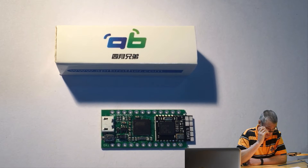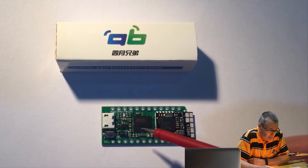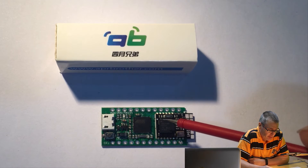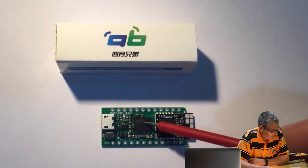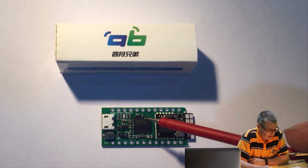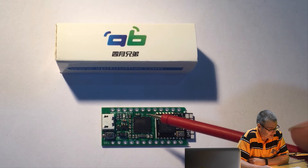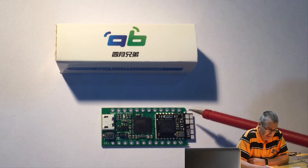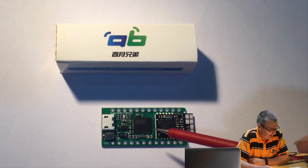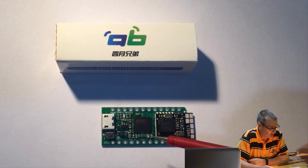The Blue Duino is an Arduino-compatible micro-sized PCB with a Bluetooth 4 module soldered on, supporting Apple's iBeacon. So that's the Bluetooth module there. The MCU used is the ATMEGA32U4 running at an 8 MHz clock rate, running on 3.3 volts, and is supported by the Arduino IDE from version 1.06 onwards. It has breakout headers on both sides of the board which pull out 18 of the most used GPIOs from the ATMEGA, namely I2C, SPI buses, serial, pulse width modulation, and analog GPIOs.